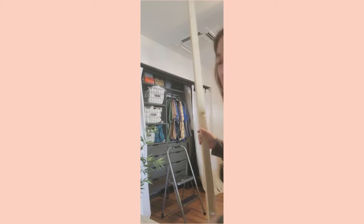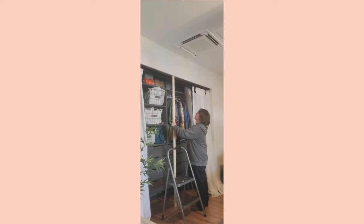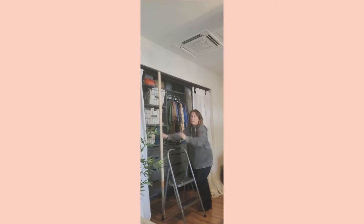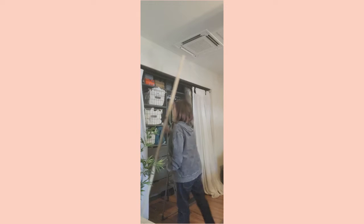So I'm gonna have to take off another quarter of an inch. So where I measured, it was 80 inches, and it fit on other areas of the closet, but when I did it right in the center, it was snug. The other areas had a little bit of room. So I'm gonna take a quarter of an inch just because the walls are wonky on top. Checking to see if it fits. I cut off a quarter of an inch more. So it fits better here in the center. So there's enough space to go back and forth. So I like to test it in 4 spots.